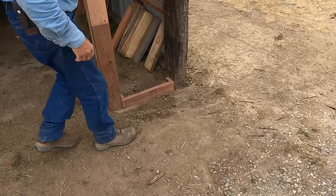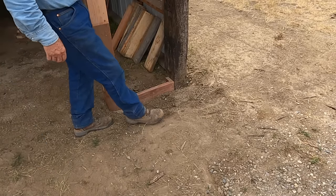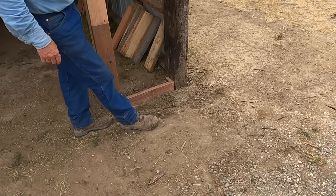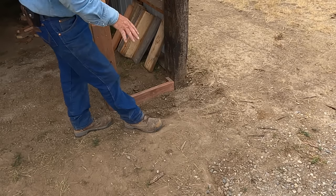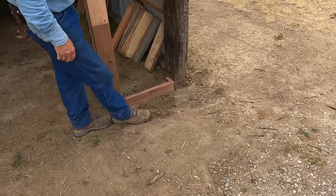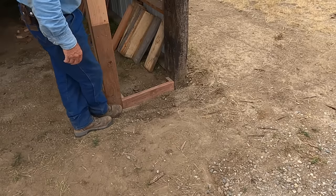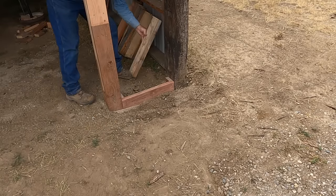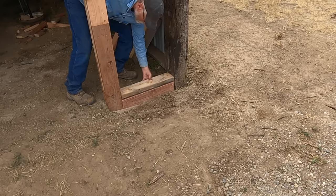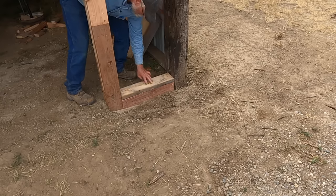On this northwest corner, I'm a little high on my dirt work here. I'll have to bring the bobcat in and dig this out, try to level this up a little bit. It's pretty hard right now, so I just took a shovel and dug that out. Got my bottom tier in and ready to start coming up for my framework every 2 feet.